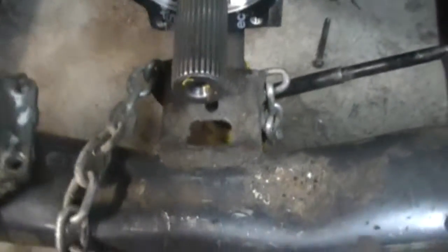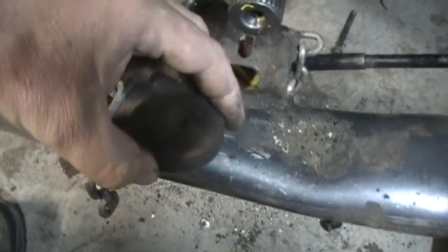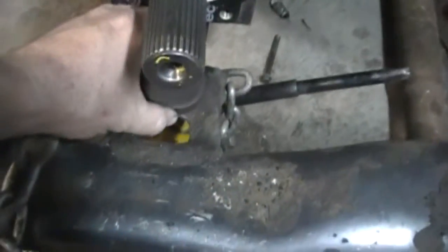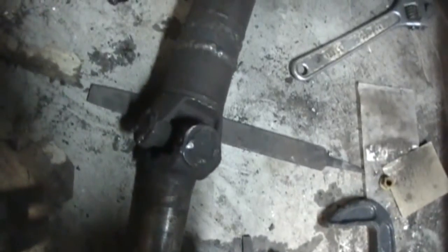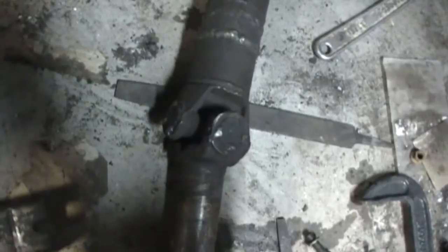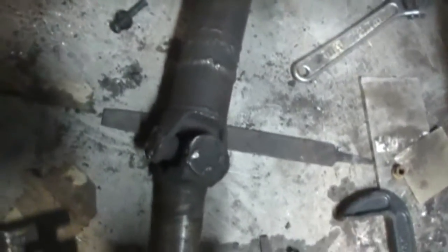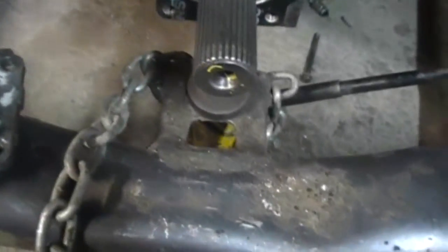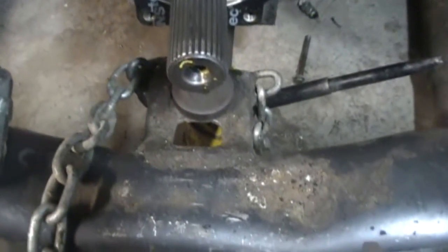Another thing I've been doing lately — I found this big spacer. I noticed I had scratches on here, which isn't that bad, but that just goes in there and lifts it up just a little. The problem I noticed was I was beating the tar out of my yoke and the welds. So before it becomes a problem — and this is what you learn, it keeps you going and lets you win instead of beating the differential out and breaking it — I just stuck that mount an extra space in there. It still works the same, still allows it to pivot.